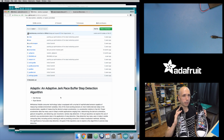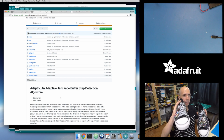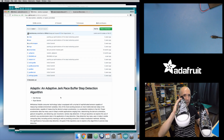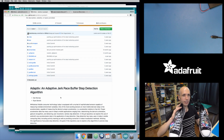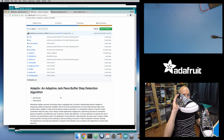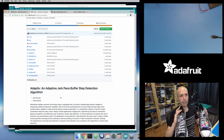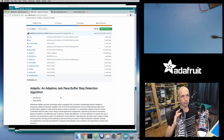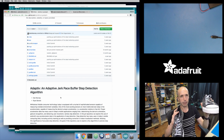And so that one worked a little better in that it was able to detect, only on the start of an upstroke, the movement. Notice how this thing turns on right as I start to move back up. It doesn't really figure out as I move down. It's only when I'm moving from down to up. Whereas the simpler one, just the filtered threshold approach, was detecting both the up and the down.